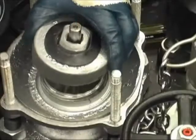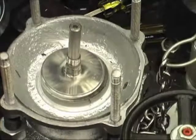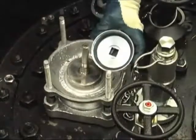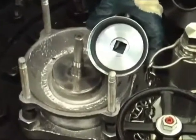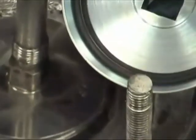Remove the retainer and look carefully for nicks, rust, scales, solidified product, and other foreign material on the valve seat. The O-ring makes its seal on the top of the crown of the valve seat and on a small area on the outboard side past the top of the seat.